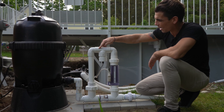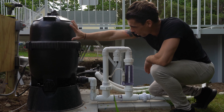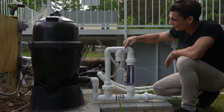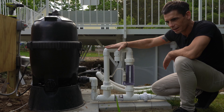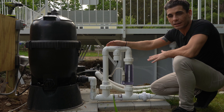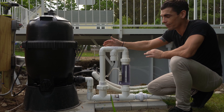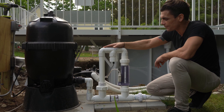The salt cell also shows you the direction of flow — you can tell the water is coming out of the filter and flowing through this way. If you ever see the arrow going the wrong direction, it has been installed wrong. It does happen; installers are human and make mistakes. It's very rare, but on occasion I've seen it.